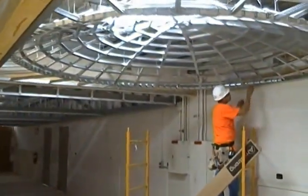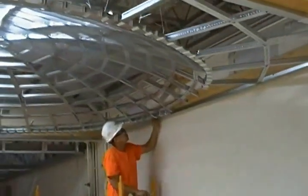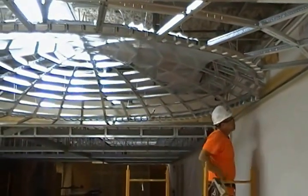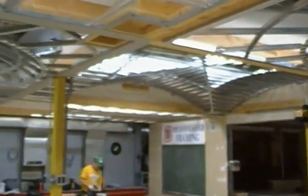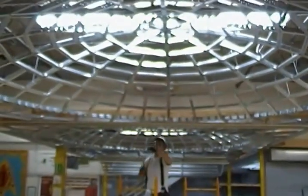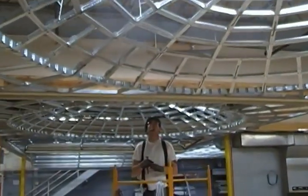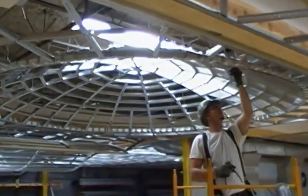We will also be using the track bender to put framing on the ends of the soffits in order to complete the ceiling. We can also attach metal lath or drywall to our structure in order to get to the finished product that we are achieving at the end.